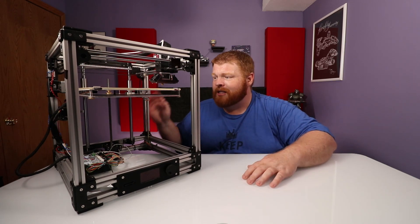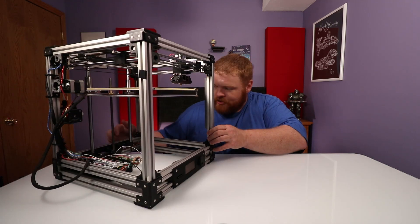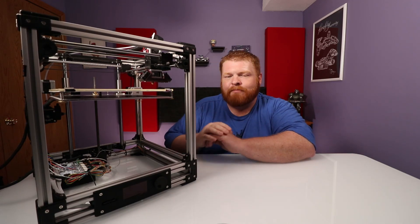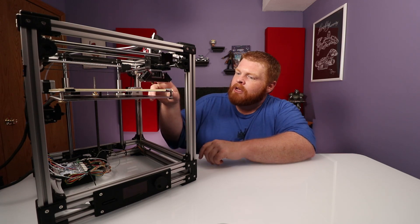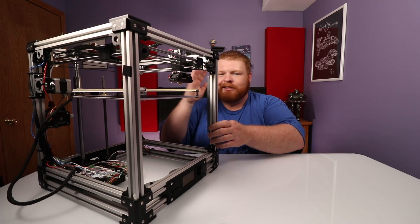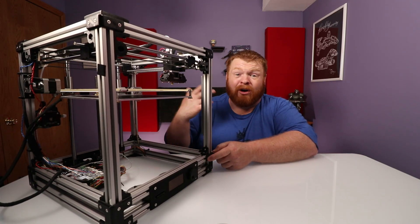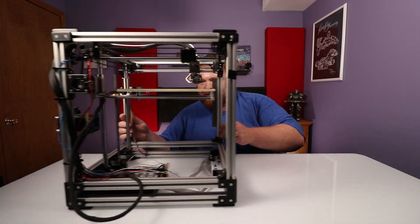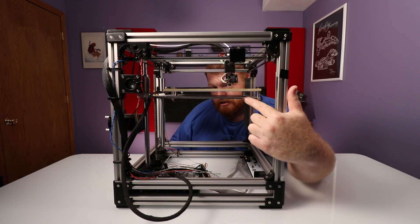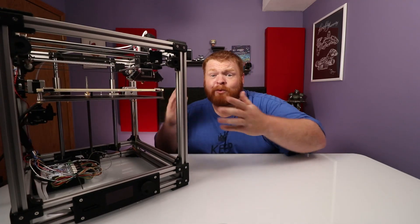A few other things I want to touch on — there are some flaws to this. One of the things I've had to reprint is a limit switch holder right on the back here. If you press down on it too far, that tends to break. I want to redo that — I'm thinking I might try and fabricate something out of metal. And also this bracket up here that holds my risers is actually a little off on the print. My first experience with 3D printing was printing off all these parts. You can see it right there — the bed is level compared to the head, but just below it the support plate is not level. Therefore it's wider at the front than at the back, and that's one of the things I want to fix.